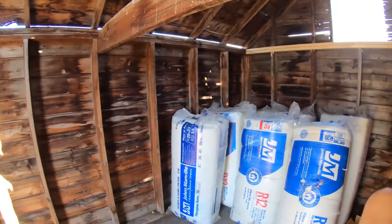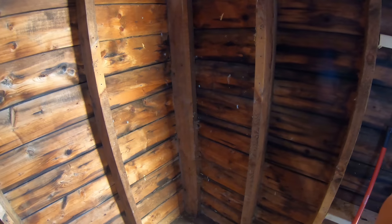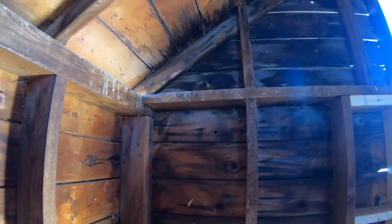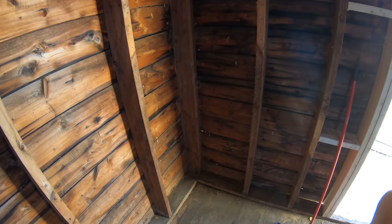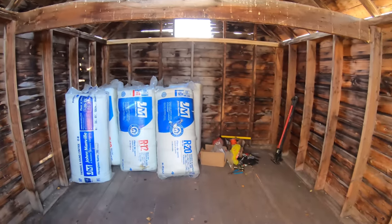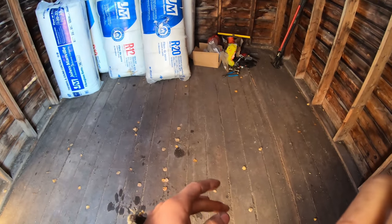Got it fixed. But you see here, I don't like how these walls are held together. It had all kinds of braces on there. But there really should be a board here to tie these two walls together. It's pretty well just relying on the top plate overlap there, and then it was relying on the braces there as well. I figure I better put a board in there on this wall here, and then nail my walls together better.